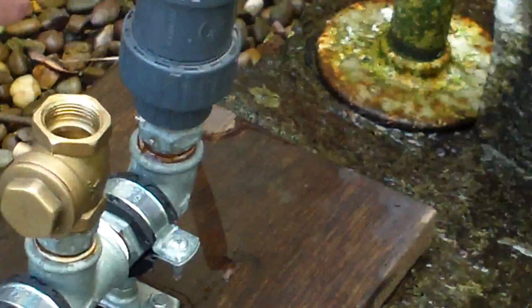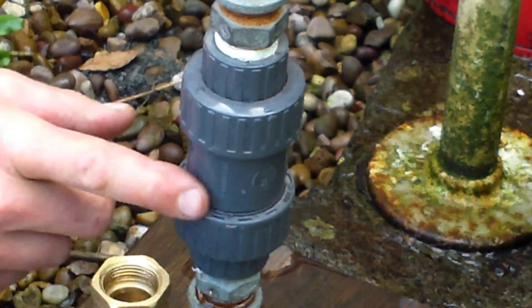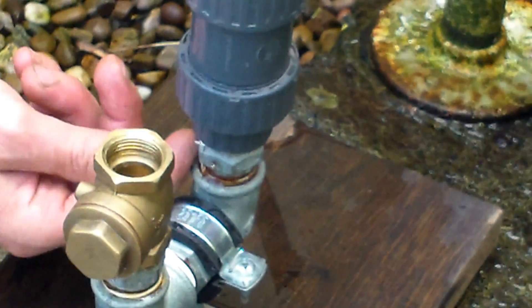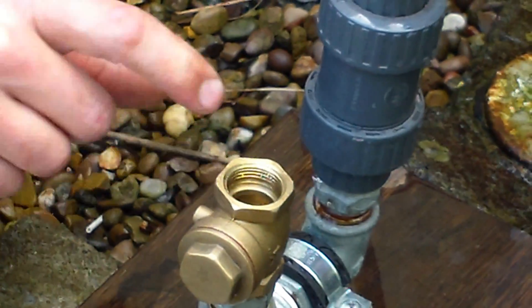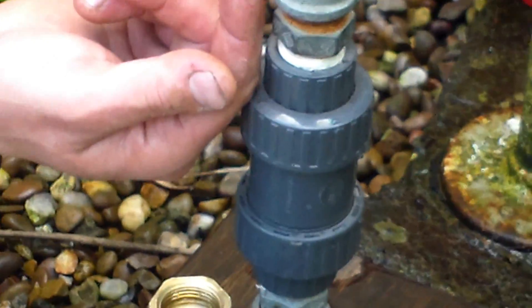This is a ball non-return valve. There's basically a nylon plastic ball that goes up and down. It seats on a little rubber seat in there. So as the water comes in here, the pressure of the water rushes in and it slams this valve shut instantly. For a split second this valve is shut. The water then — there's quite a bit of pressure built on it.